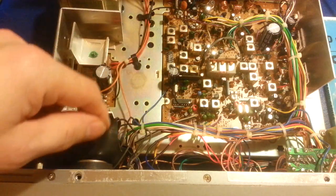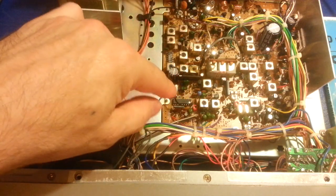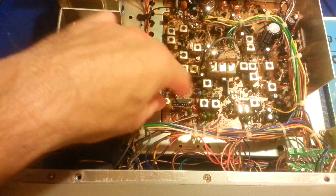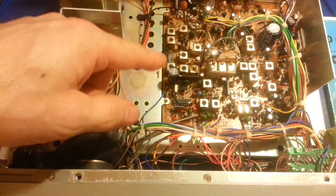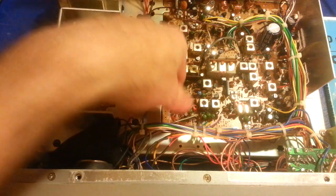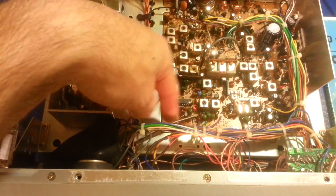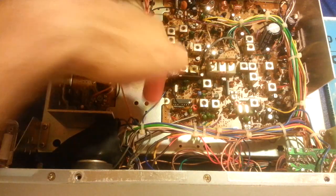That's because on those crystals, in some radios one end goes to ground, but in this one there are components in circuit on either side of the crystal. You don't want coax wrapped around the other wire because the outer shield acts almost like an antenna, capacitor, or inductor — doing all kinds of weird things to the circuit. Just use regular parallel-run wire, side by side, when using those little switchboards.